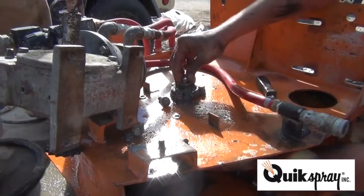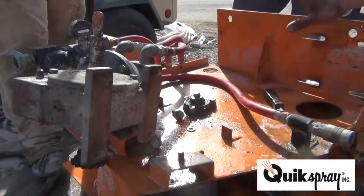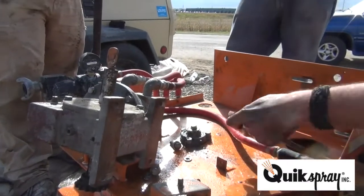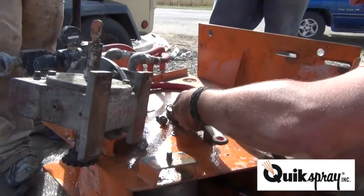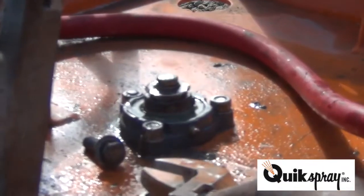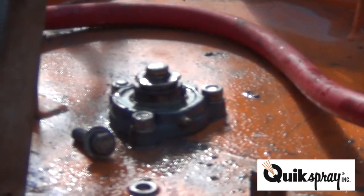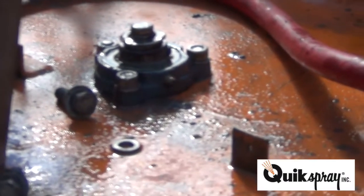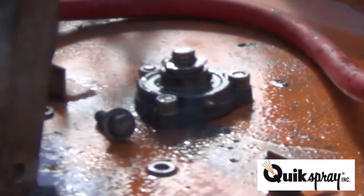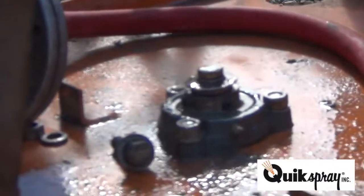Oh, to tighten back up here. So to tighten it back up with the Allen wrench. So the flat is pointing straight back. You can move this. Just a little. And now the center shaft bolt and this flat are lined up. You tighten the center shaft bolt, and then you can tighten these two retaining Allens, and then the guts are back in.